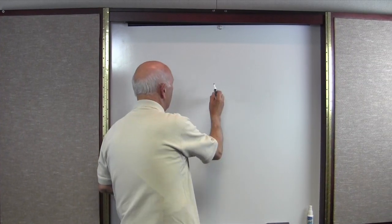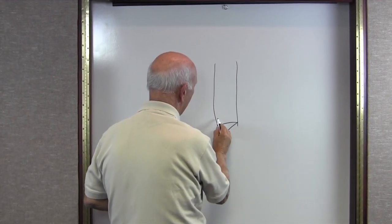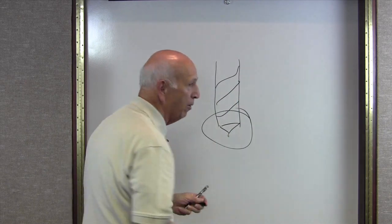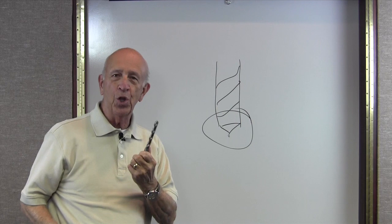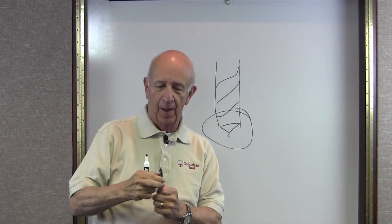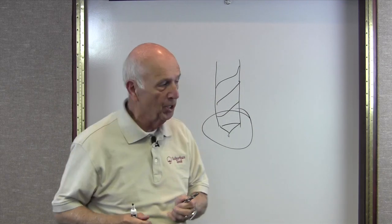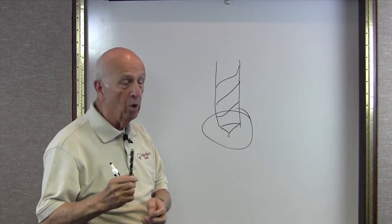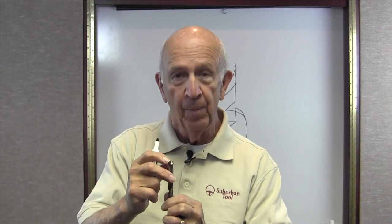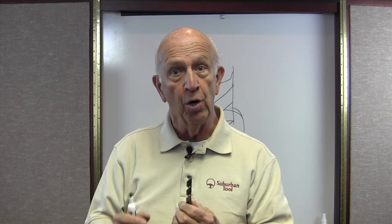Take the drill bit — not a very good drill bit, but you get the idea. What goes on right there? Think about the pressure when you're pulling down on that drill press and you're drilling that hole, and that chip's coming out of there — maybe blue hot, yellow hot, red hot, who knows? There's all that activity going on and that drill is taking a punishment. There's a toll on this tip. If you don't push hard enough, you're not being very efficient. Push too hard and you're going to destroy the drill.